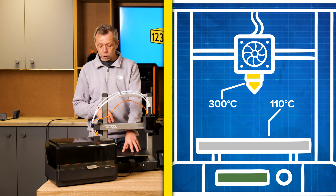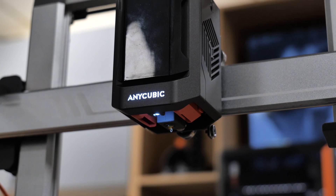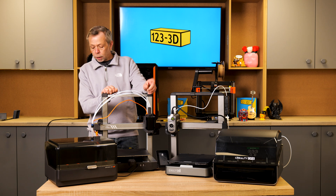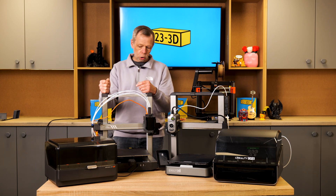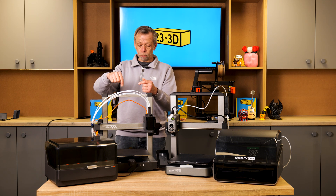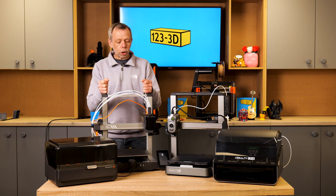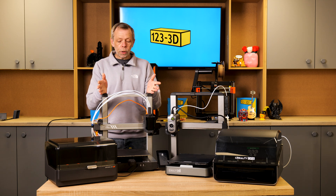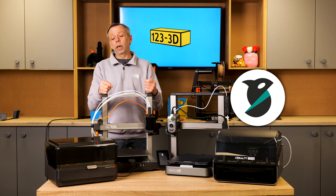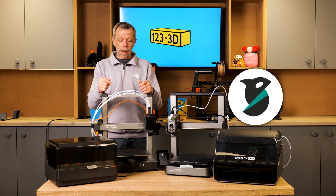The machine also has a built-in filament runout sensor in the extruder, and we boast an all-metal hot end and all-steel extruder gears, along with the capability to print up to eight colors with the ACE units — four colors per unit, with two ACE units connectable to this machine. Since release, it was initially only for use with Anycubic Slicer, but there are now working profiles for this machine on Orca Slicer, so if you prefer Orca you'll be pleased to know it's preset in the profiles.